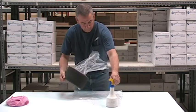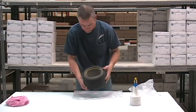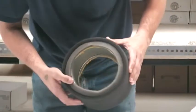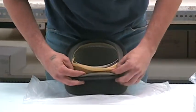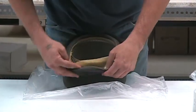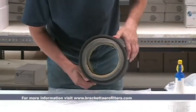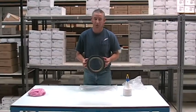Lightly pull on the plastic bag and it'll roll right out. On the bottom half you'll have your quarter inch overhang. On the top half, sometimes the second stage got rolled up, so just pull the original element down and let it roll right back up. You'll have your quarter inch overhang on each side — that's how you install a second stage element on the 102 assembly.